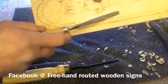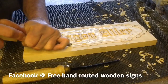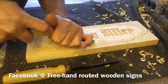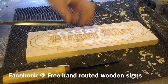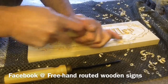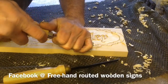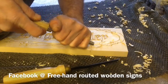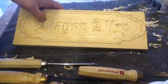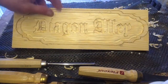I wanted to show you something more around the edge — it's just going to be getting that corner in there and taking it down a bit, just going to straighten out the edge and give the inset letters more of an outward appearance. When reaching the curves, it's going to start to go across the grain, so instead of a scoop motion you've got to twist. That's that done — so I'm going to take the jigsaw, carve the outer edge out, stick it on the router table, give it a sand and we're all done.